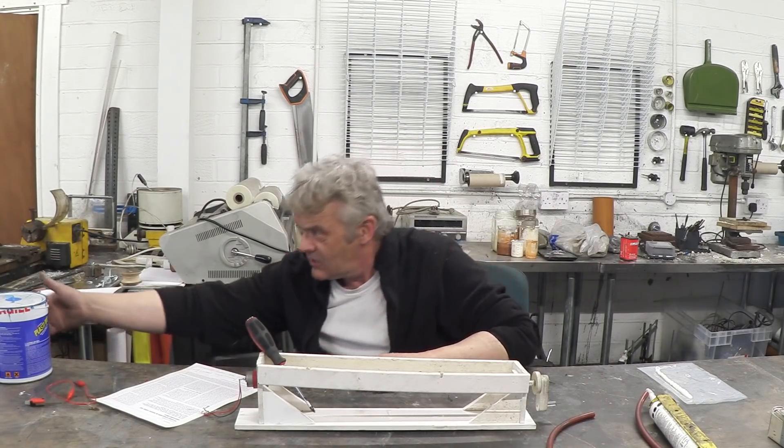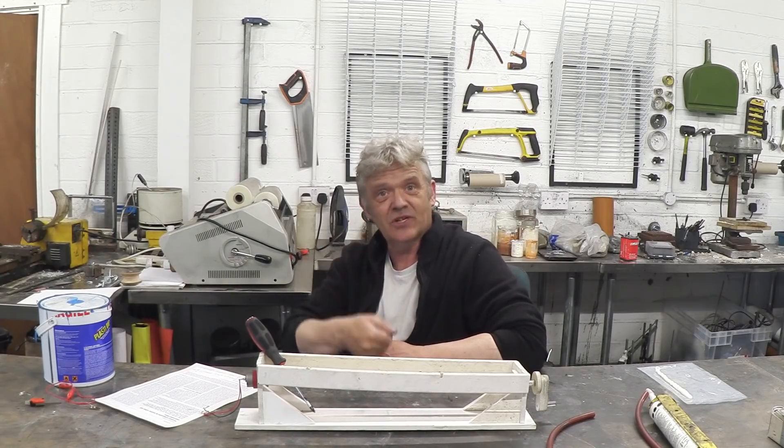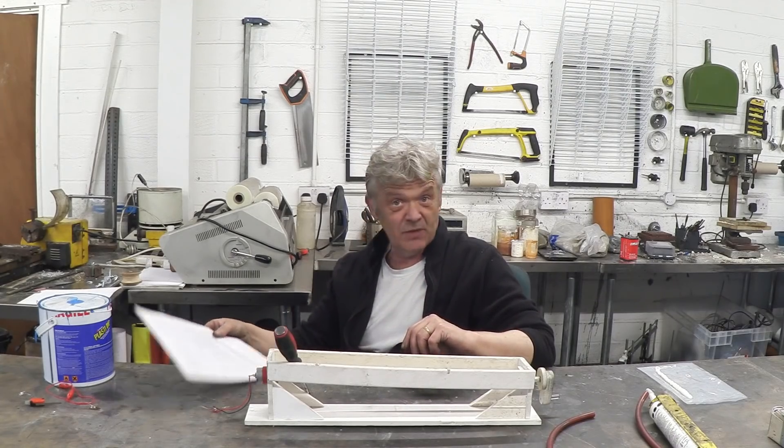Stretching and contracting by itself only gives a degree or two of difference. We got quite a good result because we used Plasti-Dip, a non-natural latex that has quite a large mechanocaloric effect — we got quite a few degrees just from stretching. But the really cool thing — pun intended — is that if you stretch it and then introduce super-coiling, it amplifies the effect and you can get 10 to 15 degrees difference. That's really significant. This is based on another paper called 'Torsional Refrigeration by Twisted, Coiled, and Supercoiled Fibers,' and those coiled-up fibers intensify the cooling effect enough to create a genuine refrigeration unit you could actually chill your beer with.